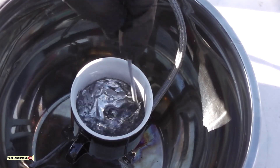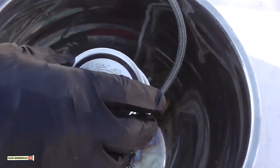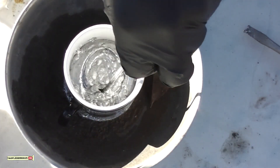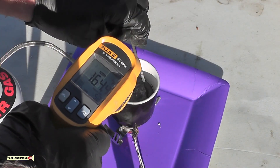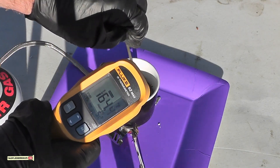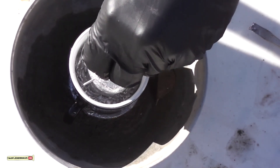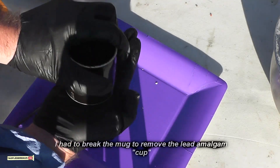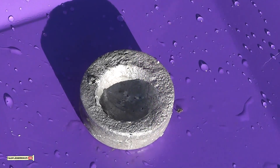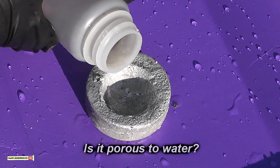After only a few minutes it was completely melted and at that point I turned off the heat. You can see it's starting to cool off and become kind of a thick paste — it's essentially still a liquid at 164 degrees Fahrenheit. I then plunged in an aluminum form that I made to create that cavity. Since it didn't want to drop out of the ceramic mug I had to break it apart to retrieve the very fragile little lead amalgam cup.